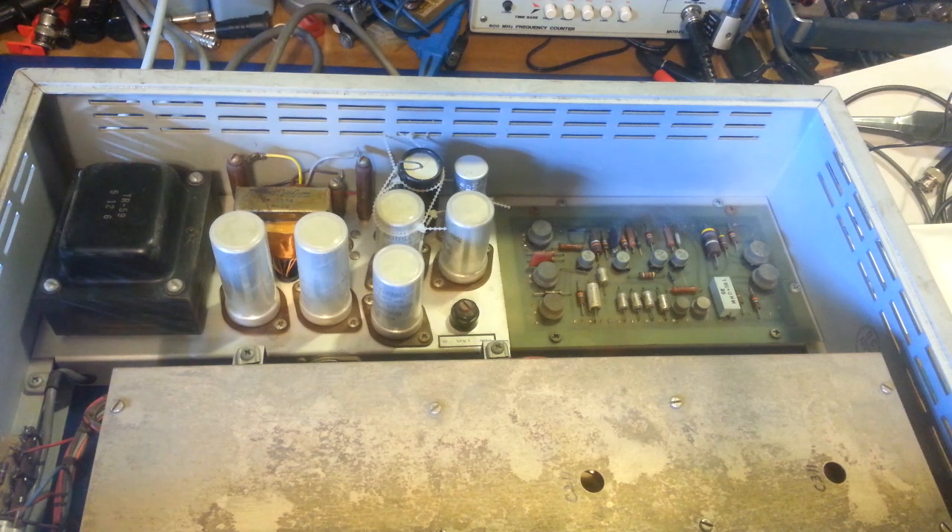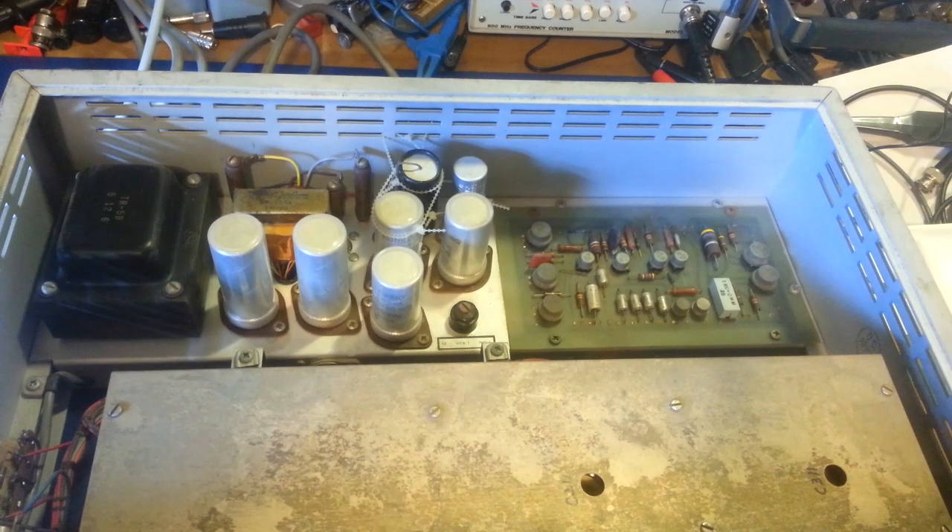Yeah, big difference in capacitor sizes nowadays. I've got so many radios to work on it's not even funny, but I do need to get this done because it's going on the bench to be used. I wanted a wideband amplifier for a long time but all I'd ever see was 50-ohm input impedance. You can do impedance matching but it's not ideal. This is exactly what this was designed for - even the owner's manual says it was designed to be a high input impedance amplifier that could then be attached to frequency counters, oscilloscopes, or any other type of test equipment. It's basically a preamp stage to your test equipment.